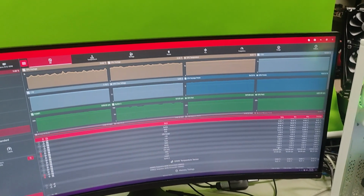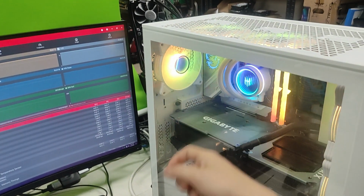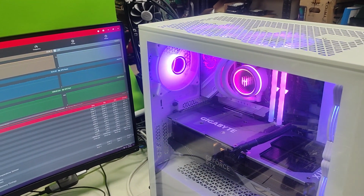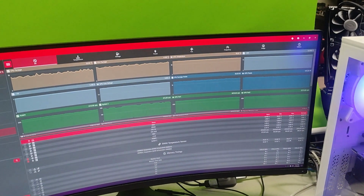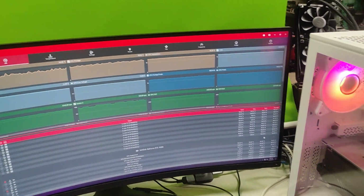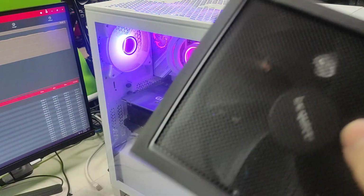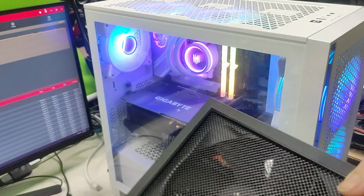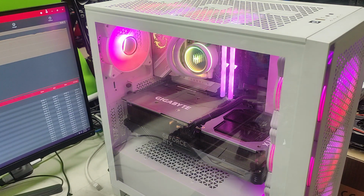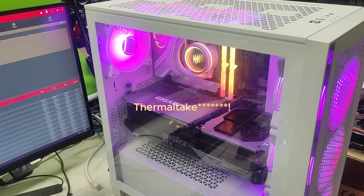So starting from the top, Thermaltake GF3. Do not get the GFA3. That thing is a literal scam. It will weigh half the weight of the GF3. I'm not even joking. And it'll weigh a third of what a Corsair HX or RMX would weigh, and that's insane. So it's a 1200 watt power supply that weighs less than this Dark Power, like nearly half the weight of this Dark Power supply, and this is only an 850 watt power supply, and this is 80 Plus Titanium too. Even though that thing's gold rated, a GFA3, I think they really need to recall that product. It's a bad product.